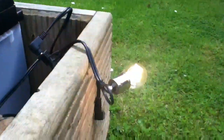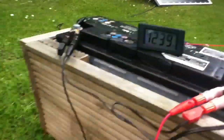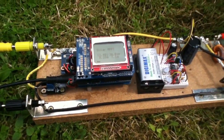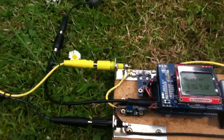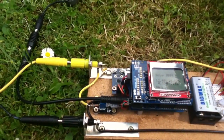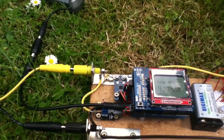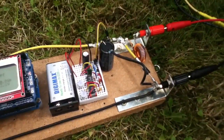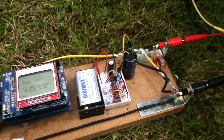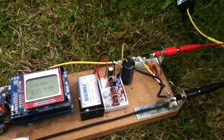The battery's here, and I've got a light bulb draining it down, making sure the voltage doesn't go too high — 12.4 volts at the moment. A 40-watt transfer of power involves a huge mismatch in voltage, because the voltage at the solar panel end is going to be around 35 volts — twice the 17.5V maximum power point of each panel — and the battery voltage should be about 12.5V. So the buck converter does that voltage conversion, and of course as it steps the voltage down, it steps the current up.